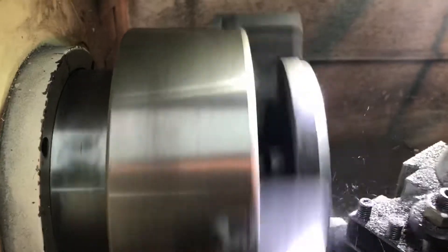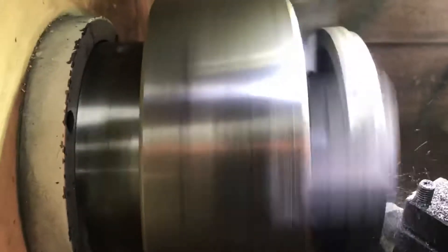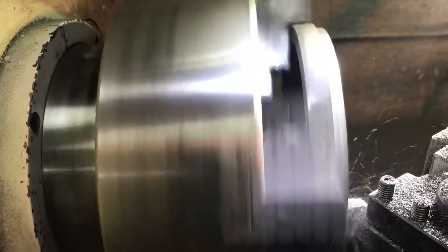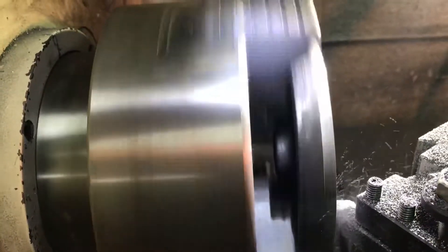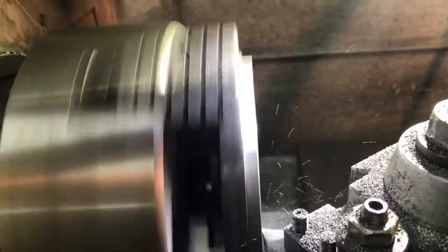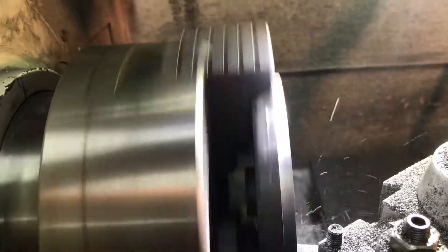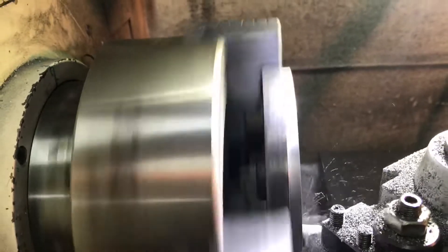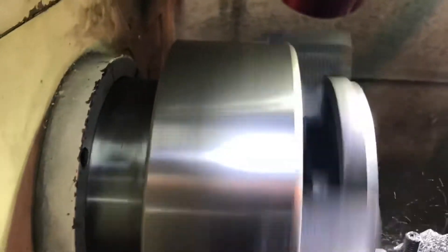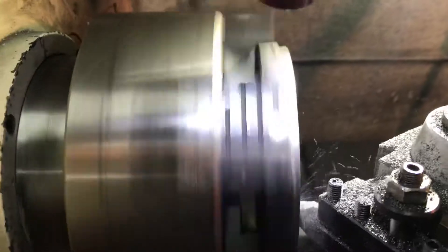You probably can't see that — let me see if I can get my flashlight out. There's a little stub in there; there you can see it now. That's the part that's going to be bored out for the table stem. What I'll do is I'll have a nice shoulder for the screw to grab against the chuck floor. I'll put some paper in there — some little business card pieces or brass — to give me a little space, flip it around, center it carefully on that stem, and then I'll be able to machine the back edge and the remainder of the shoulder.